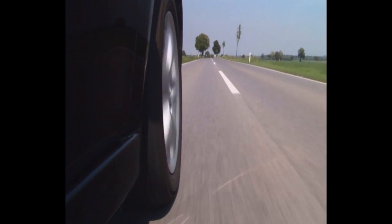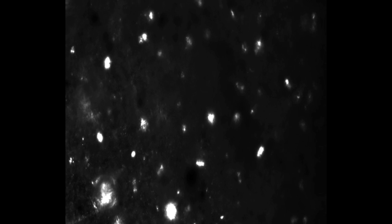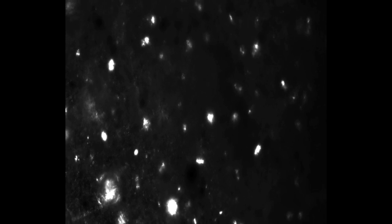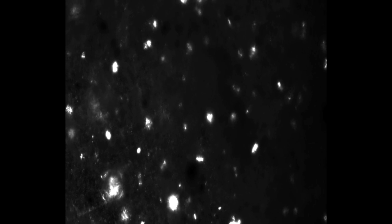This image shows the SKF GHG Grease magnified 200 times. The white specks represent the crystalline structures before the hub has been installed. This image shows the SKF GHG Grease again after the hub has been run for 8 hours. You can see the crystalline structures have become much smaller in size.